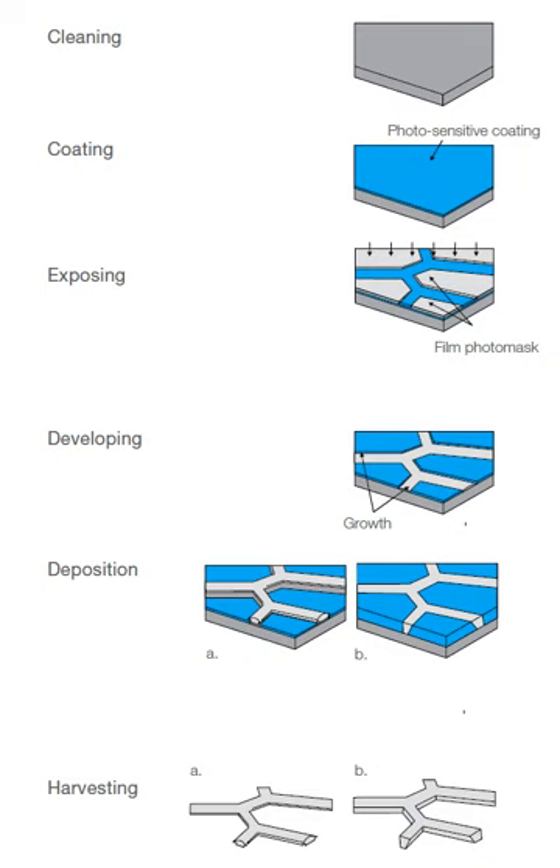The main advantage of electroforming is that it reproduces the external shape of the mandrel within one micrometer. Generally, forming an internal cavity accurately is more difficult than forming an external shape; however the opposite holds true for electroforming because the mandrel's exterior can be accurately machined. Compared to other basic metal forming processes — casting, forging, stamping, deep drawing, machining and fabricating — electroforming is very effective when requirements call for extreme tolerances, complexity or light weight.